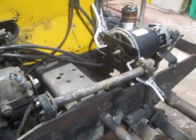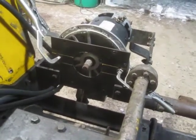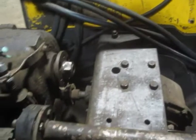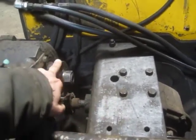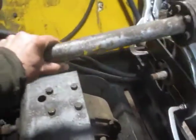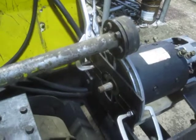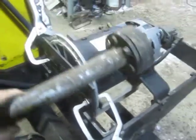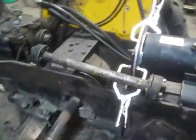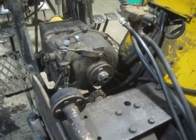These tractors are so easy to adapt to a new drivetrain because the plate I've temporarily clamped the DC motor to is the mounting plate of the original motor, and from there it runs up to the input on the clutch housing. The two are just connected with a shaft with some rubber donut joints at either end. I'll have to modify the shaft or back the motor up a little bit, but really everything is very modular.